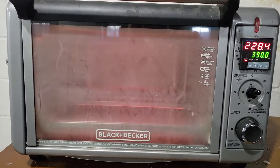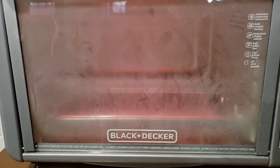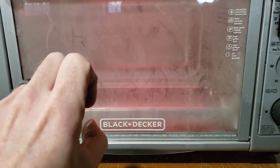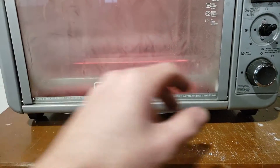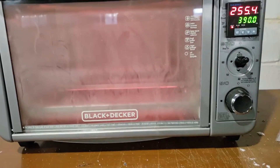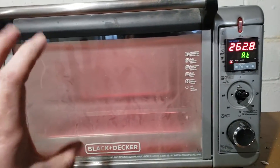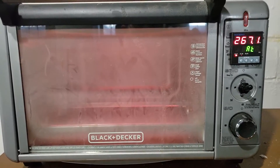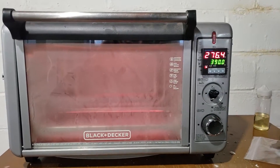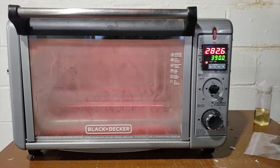From a safety standpoint, it's not going to burn you if you put your hand on it with that ceramic insulation. Now, typically these elements turn on and off intermittently — when you set your knob it just cycles on and off. That's not great, but with the PID running, the elements stay on until the temperature hits the setpoint, then they start fluctuating to maintain it. So it should preheat a hell of a lot faster. With this auto-tune, I want to see what it does and how much it overshoots.